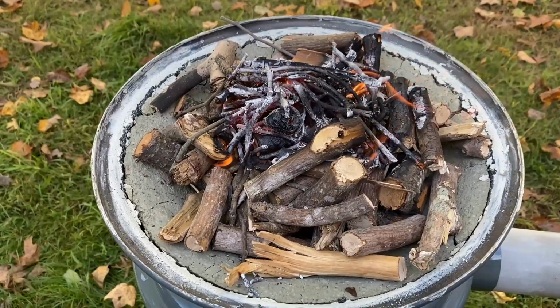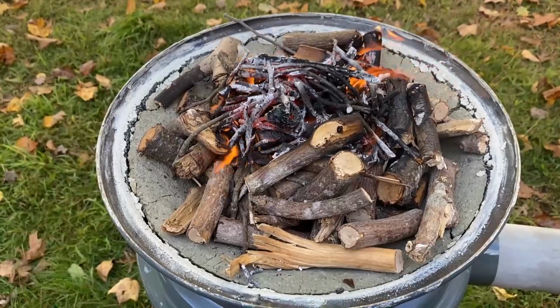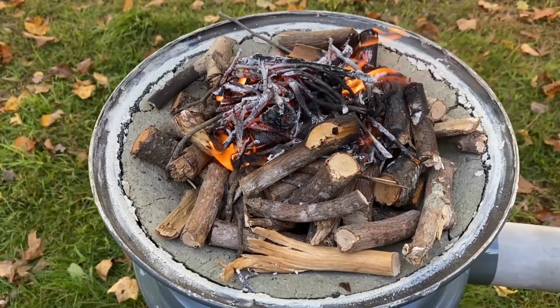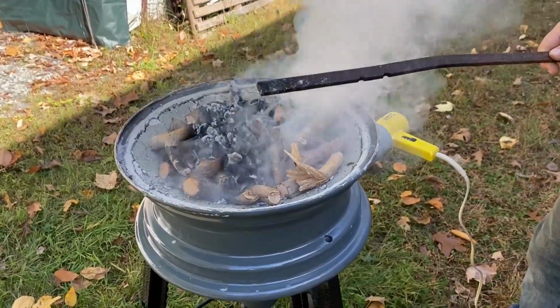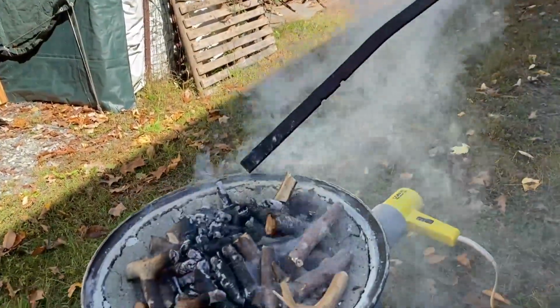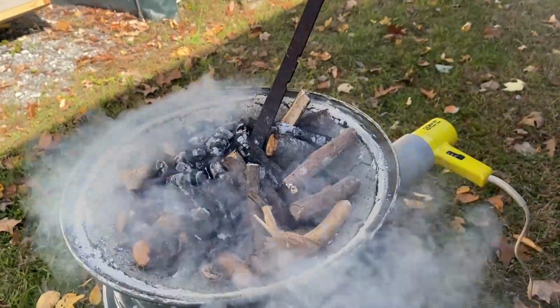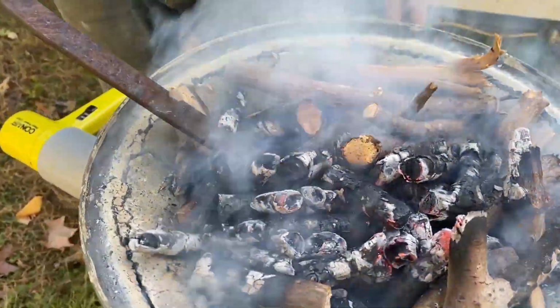You won't be able to do that with a wood fire, but you will be able to shape metal, and that's really all we're gonna be doing probably in the next video when I make those sign hangers. Okay, now that we have a decent coal bed, I've got this piece of steel. I'm just gonna use this as an example. I'll stick this in the sweet spot, which is kind of in the middle, right above those grates that we built, that grid, and we want to make sure it's covered with coals.